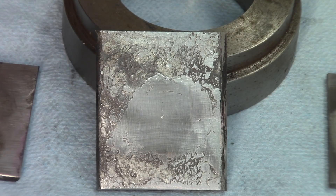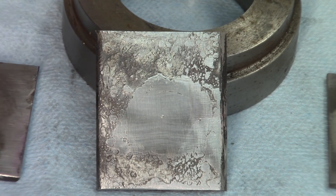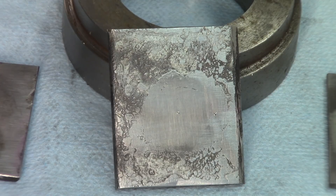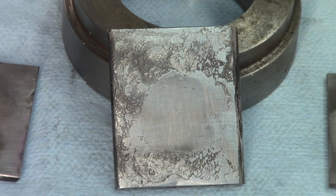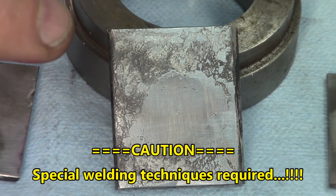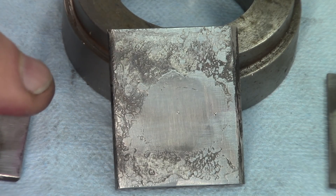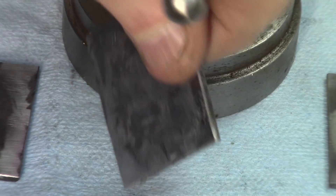Using hot water, just near boiling point, could probably help. Also pulling it out from the water while it's still pretty hot, without cooling it down totally, would probably improve those characteristics. Bed frame stuff is hard to find definite specs about, and it's not easy to get a very consistent material within the years or batches. So use it at your own risk. Welding this and using it as trailers or anything life-threatening — I really don't suggest any welded parts. Riveted parts, fastener-mounted parts, use it exactly as it's been used as a bed frame — that could be no problem. But if welded, you're prone to end up with these kinds of cracks.